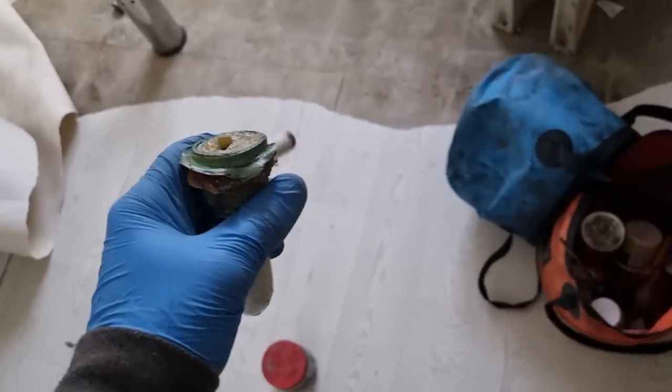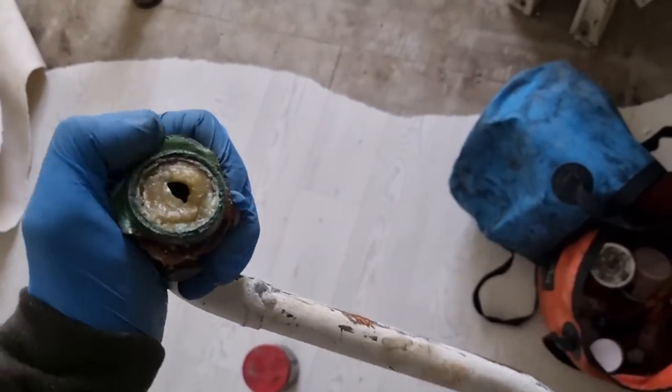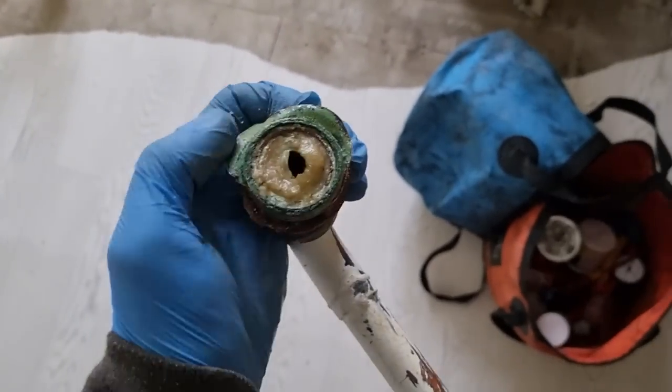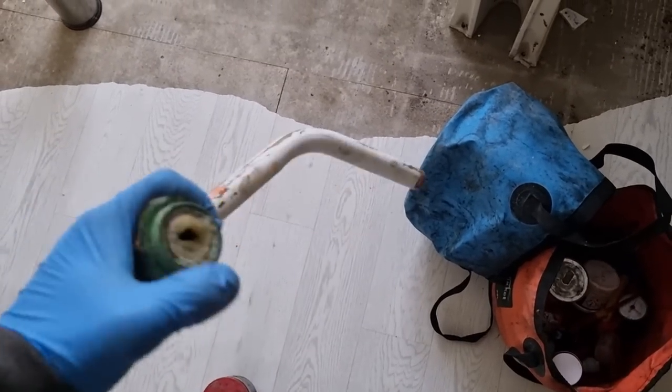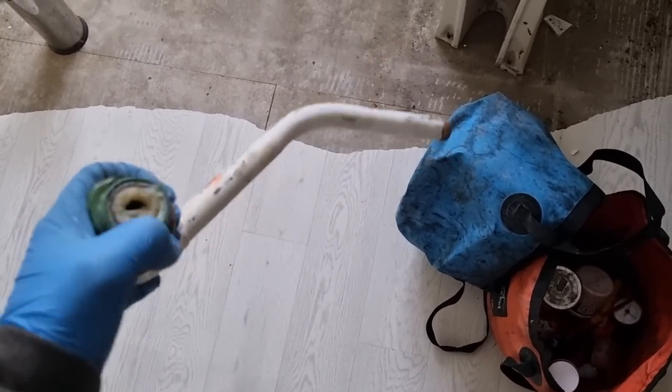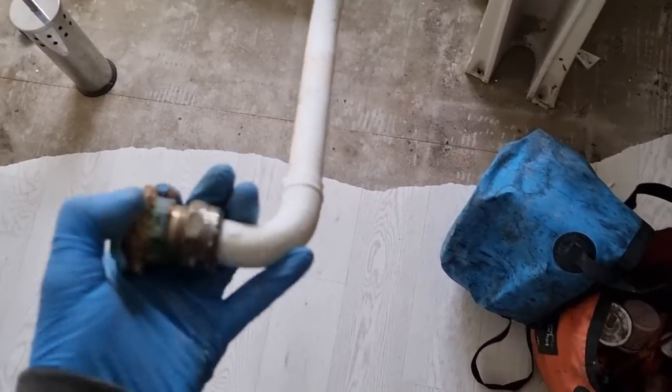Just took that off the top of the cylinder. That's the cylinder connection. They put that much putty around it. It's actually blocked the feed. Look, imagine that's the hot draw-off. And that's literally, well, it's got like a 6mm hole in it now.